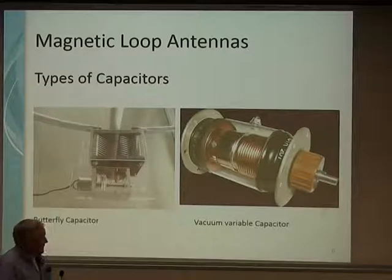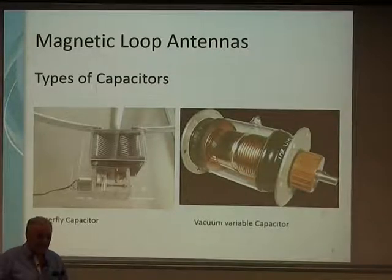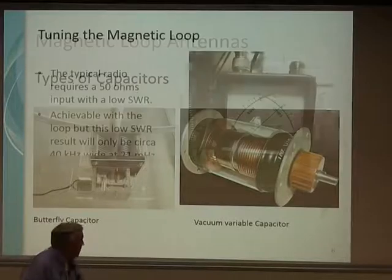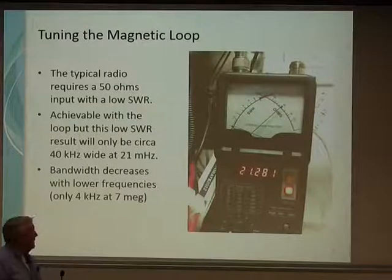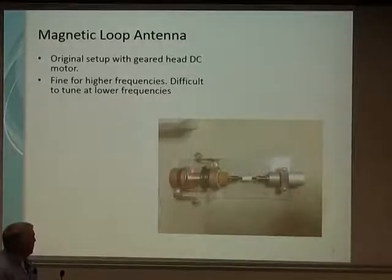There are lots of things about loops. You think it's just four pieces of pipe or a round circle and there's not much in it — there's a lot in it. It's all Ohm's law and it's all about losses. There's an example of a match — 50 ohms at one-to-one — and it's pretty easy to achieve that. The little transformer on that one there works on any loop, but the gamma match, if you're making something permanent, is probably the best way to go. I think I'll let Dave take over from here.